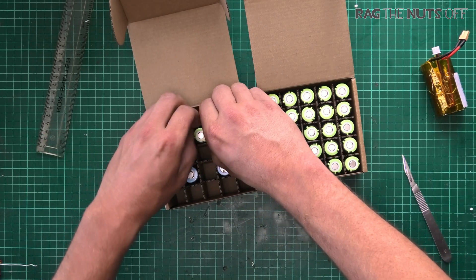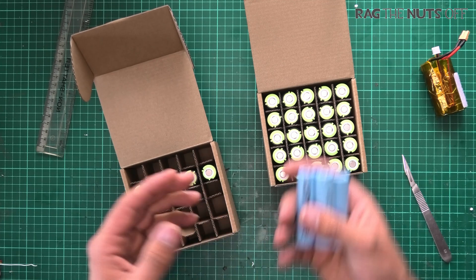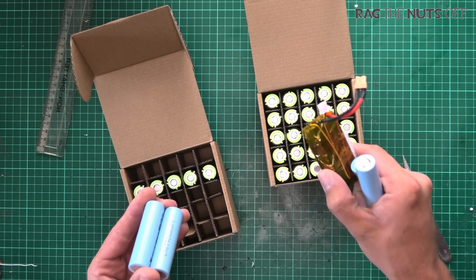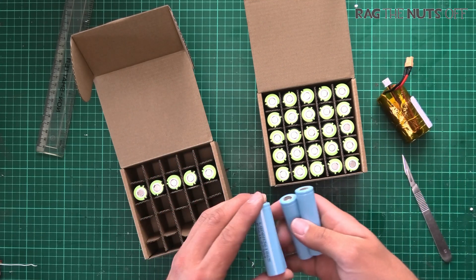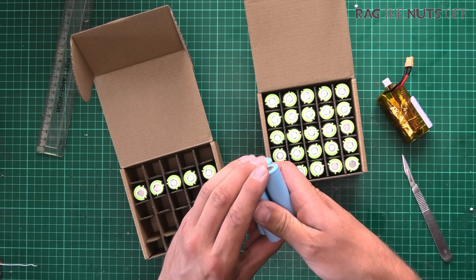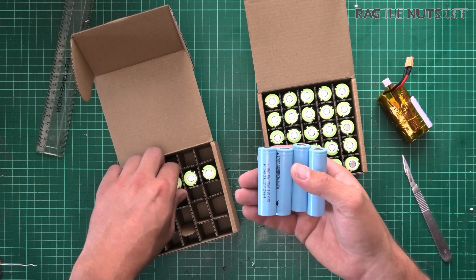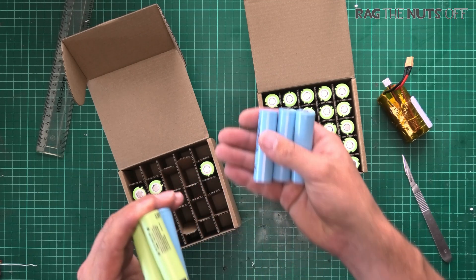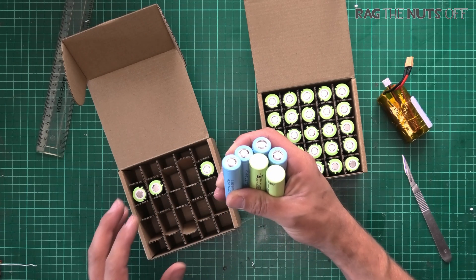You also have the challenge of joining these cells together. So if I pick on that little 2S to begin with - looking at these purple ones and blue ones - what we've got there is a 2S 1P battery. It's 2S because there's two cells, and 1P because it's one battery in parallel. If I wanted double the capacity but still 2S, I could put four of these together to make 2S 2P. I could go wider and make a 4S battery, or make a 3S. I would go from say 3400 milliamp-hours and by putting them into parallel go to 6800.